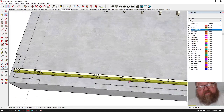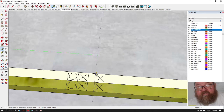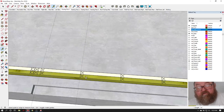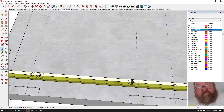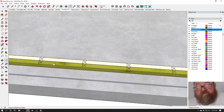But anyway, at this point, you'll start to come down. You'll see that the next stud is 4 feet, and then you'll make a mark there. You'll lay that out, and then you'll just continue on down 16. Because you've already got your first stud marked and you're hooked over that nail, you can go 16 inches now. So you just go down through here, marking your studs,